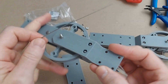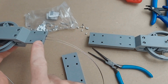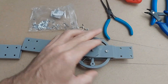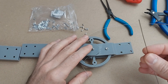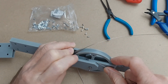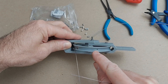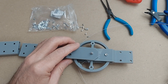Now that I've got this through here, my next job is to pass the wires through both pieces of square channel and then around the other pulley. Just make sure when you get to the other side that the longer cable has the longer trip to make to get to its wire channel, and the shorter cable has the shorter trip to make to get to its wire channel — and then you'll end up with them being parallel.